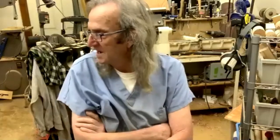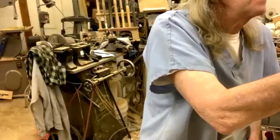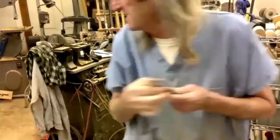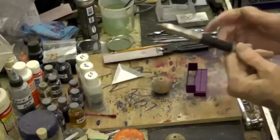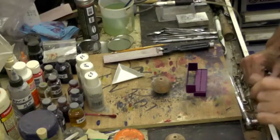I use those burrs about every day — I'm a dental lab technician. Those are standard burrs, yes — bigger ones and smaller ones too. You can use a regular hand piece as well. What I'm using is an NSK Presto — it's basically a dental lab tool. It's air driven and turns at 350,000 RPM. I run it at about 38 PSI. The beauty is even with a little pony compressor you can keep up with that machine.